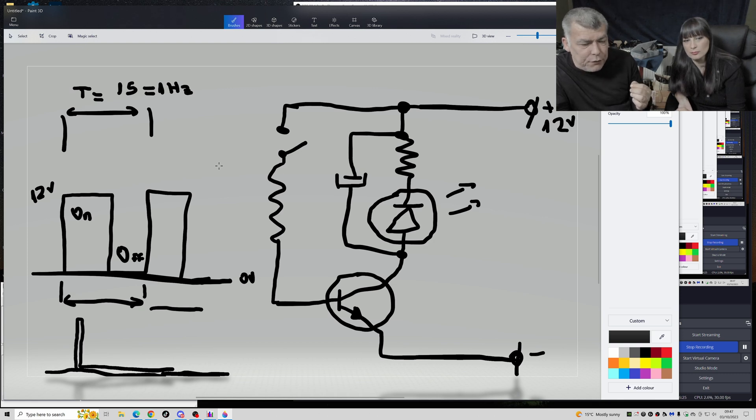It comes back to the frequency - when you're touching and taking breaks 100,000 times per second, it's very different from what we see now at one time per second. The higher you go in frequency, the smaller capacitor you need, because the capacitor doesn't get fully charged anyway - just a little bit. So there's no point in a bigger capacitor if the touch frequency is higher. It's wasted - it won't get charged.